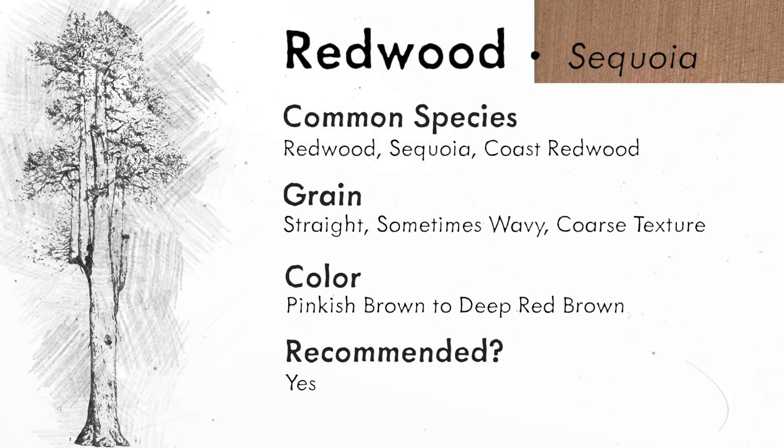If you like dark or colorful woods like redwood, sequoia, or cedar, they have their own color — but on the flip side you won't be able to stain them any color you want because they already have a strong predominance in one direction. Cedar's biggest downside is its weakness. For bigger spans or tension loading you really have to fight that — you'd need big chunky massive pieces, creative use of metal, because cedar just doesn't take those tension or compression forces well when you get into bigger spans.